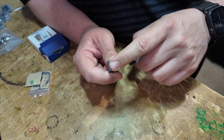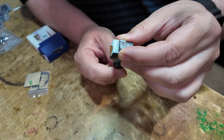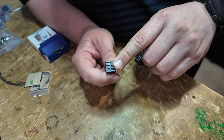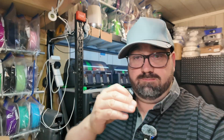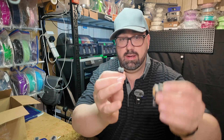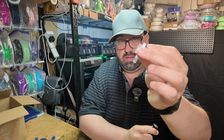It could be so much better if it were slower. The G-code I've put in there also slows down the rate at which it goes over, because this is not like the original wiper. The original wiper was more like a rolling pin on a little stick — that worked much better with a high velocity going across the top of it. This one, like the A1, works a lot better when it's slowed down and the rubber is given time to grip what's on the nozzle.